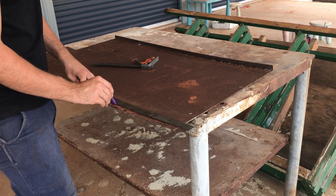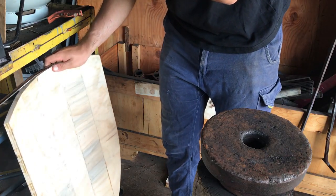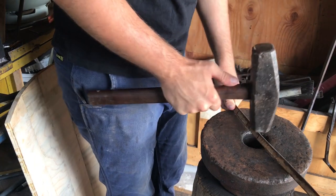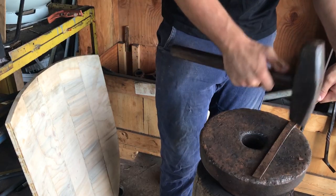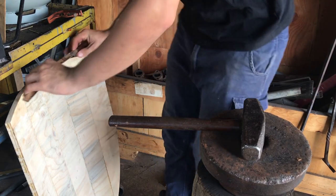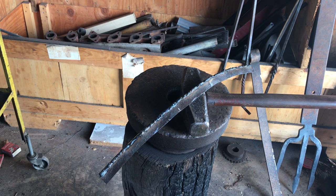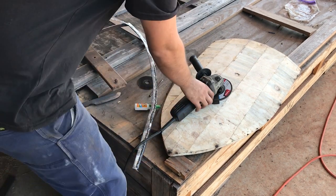I tried metal strips to cover the top and front. This one actually ended up all right — so what I did is I made the front and then I made the sides and welded them together, but they warped too much in the welding process. So what I did is I just ground off the welds and just put the front banding on.